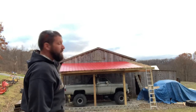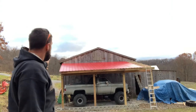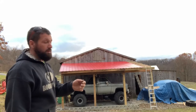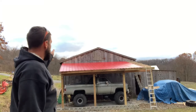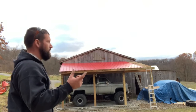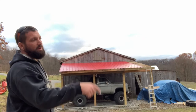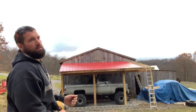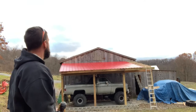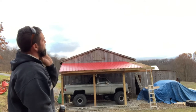But yeah, if you just start off square, down here you measure off your overhang where you want your roof. Don't forget to allow for your barn siding, your trim, anything you're putting on there, doors. So I allowed 4.5 for mine, because I'm putting 1.5 inch plywood runner, 1 inch barn siding, that's 2.5, and then a piece of 3/4 round trim. So that's almost 3.5, so another inch I at least want lip overhanging off that. My gutter, I'm allowing for a couple, I think 3 inch overhanging in my gutter, 2 or 3 inch.